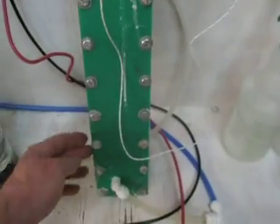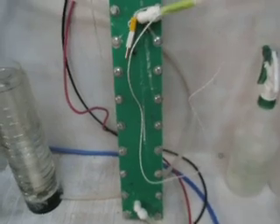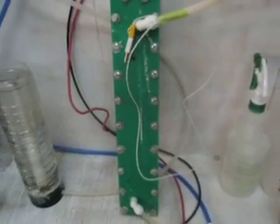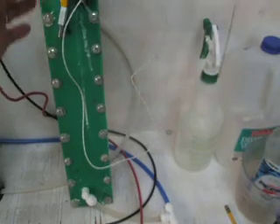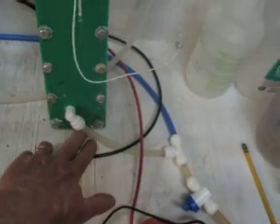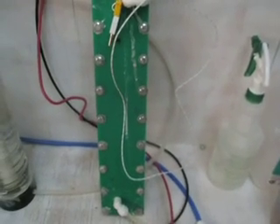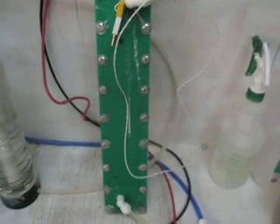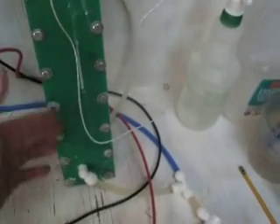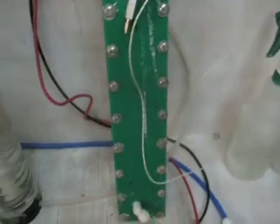The resistance in stainless steel metal — on a cell like this where I've got 15 to 16 inches of plate area — it might very well be a good idea to put a couple of terminals at the bottom, feeding it from both directions, because there's got to be quite a bit of heat loss just in the stainless steel itself.